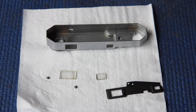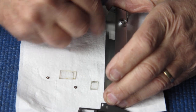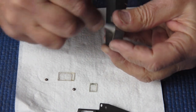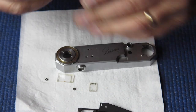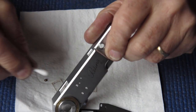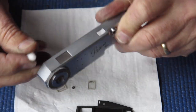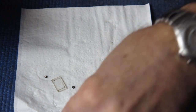I'm just going to clean the inside of the camera top cover now with a bit of naphtha. This is generally quite clean, but no one had had that plate off, so where that plate sat was quite dirty. I'll clean around the apertures here for the windows. That top cover is otherwise clean because it's been cleaned previously, as has the shoe.